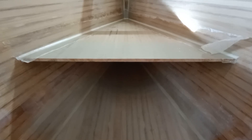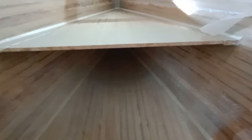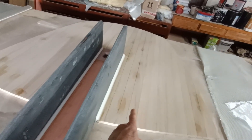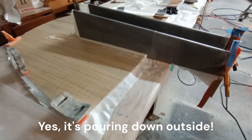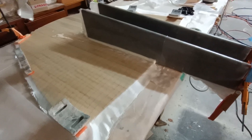Before the deck goes on, this is another one of those jobs it's best to do now. I glued in the anchor locker floor, coved it and glassed it. Getting in there was no fun, and glassing those corners — no peel ply on those — it was not an easy job, especially for someone who doesn't do yoga. This cove here is still uncured so I don't need to sand that; it'll get a good bond. I'll be wrapping some double bias over and through the bottom, over around and out, and then there'll be another layer over that which encompasses it all. The glassing of the tabernacle to the bulkhead, 1.5 meters from the bow, went quite well.